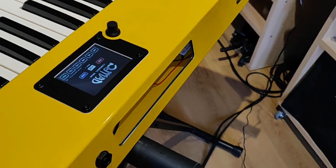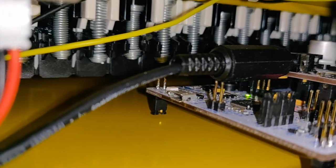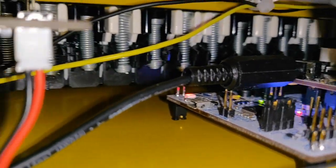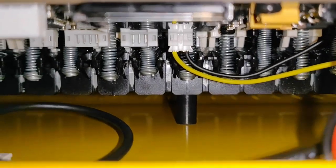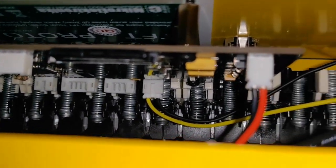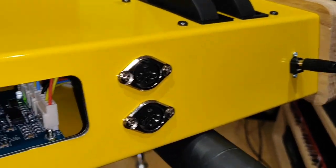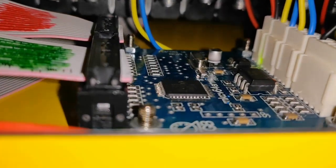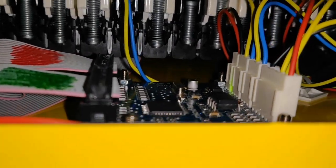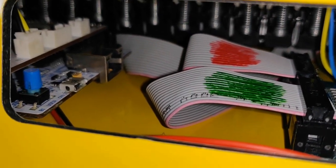I'll start with a brief visit of the hardware. That white board here is a ST Nucleo development board with a powerful H7 STM32 device. The second board is a custom PCB developed to manage the display and the user interface. On the other side, you'll find MIDI sockets, and that board is the MIDI encoder that drives the keybed and translates keyboard action into MIDI messages. And that's the other end of the CPU board.